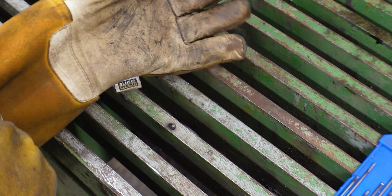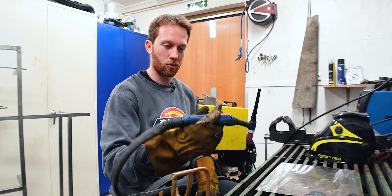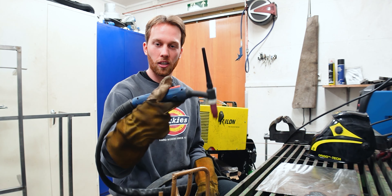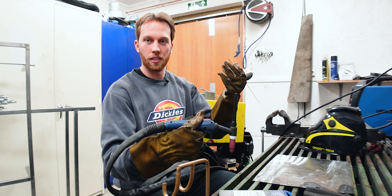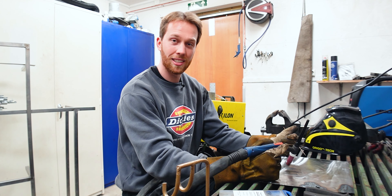Before we start, we need to figure out the best position to hold the torch. There's this long cable attached, so that goes on the lap, and then apparently you're supposed to grip it like a cigar — between your index and middle finger — and it's supposed to float on the back of your hand in any position. The filler rod is held in kind of the same position.